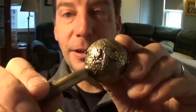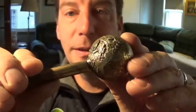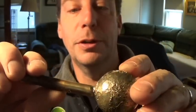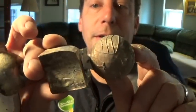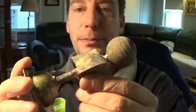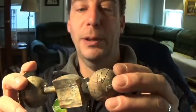And if you can see what happens if you don't get enough metal fed into your part. Now, this saw just shrinkage mostly. It might be a little bit of a dross inclusion in there as well, but you know, adding a nice feeder onto it, you don't have that problem. Somebody had asked me about that, you know, as far as hot tears and shrinks and stuff like that, and I wanted to kind of show how to go about doing it so that you can get a nice thick part cast without it screwing up on you. That's all.